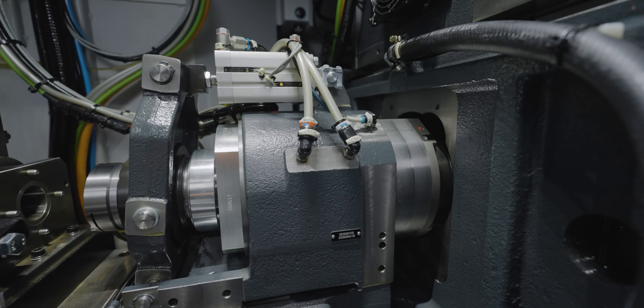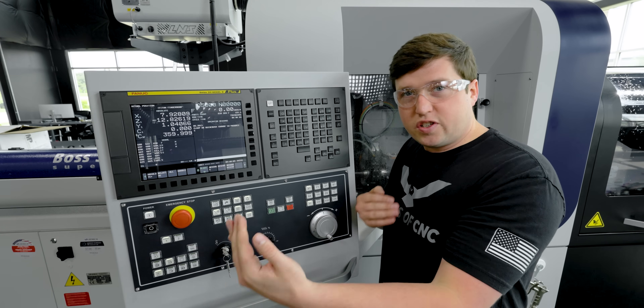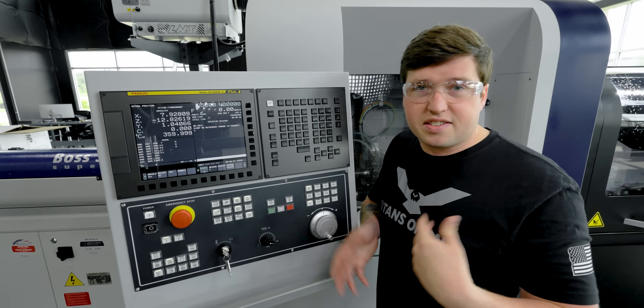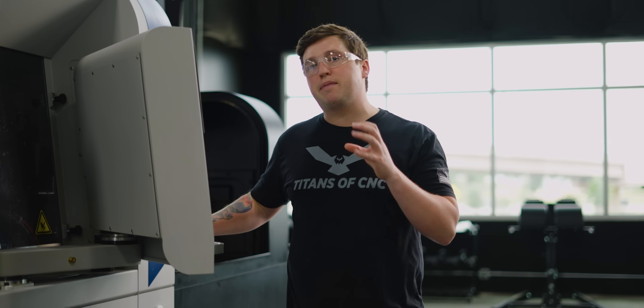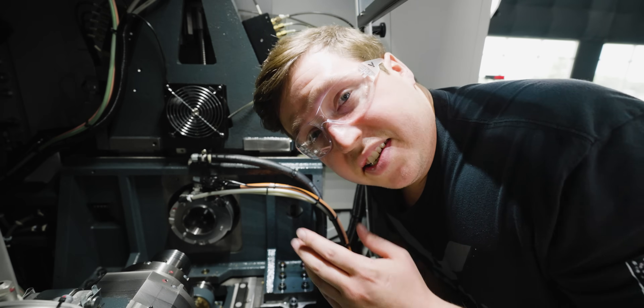What's nice about that is you can jog the spindle back. It'll be in an alarm state, but if someone accidentally leaves the spindle back and puts new material in the machine sticking out like two feet, they can't start the machine up — they have to look in and see what they're doing. So it's a good thing it does this. Now let's take the entire guide bushing unit out of this machine and turn it from a Swiss lathe into a conventional lathe.